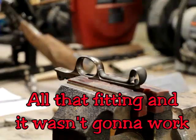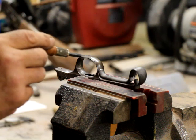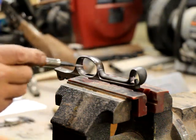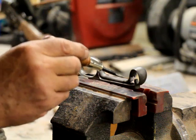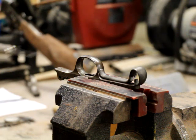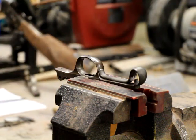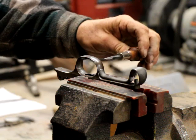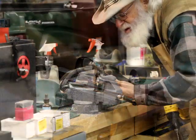What I've done is cut the loop off of this trigger guard and I've been grinding it to fit here. From the other side where it won't be in the way, I'm gonna run some metal screws to hold this down. When I polish it all and blue it all, this will come together. This isn't polished — it's just cast — but I'll polish that out and polish out the scratches. This will be like an early model trigger guard with this part here, and I like it.